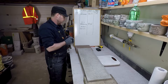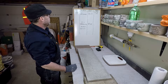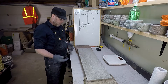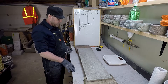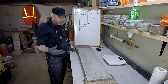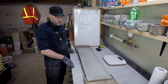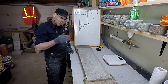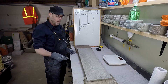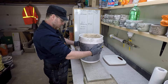So how much weight is this going to take? My guess: 36 pounds would give it a strength-to-weight ratio of 3. I think it should take 30 to 40 pounds. Based on other tests with the 6:1 vermiculite-to-cement mix, I'd expect this to be stronger because of the higher cement ratio — but it is a wet mix versus a dry mix, so it'll be interesting to see if the extra water has compromised the strength.